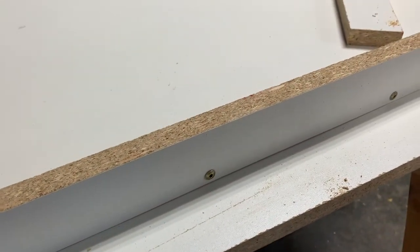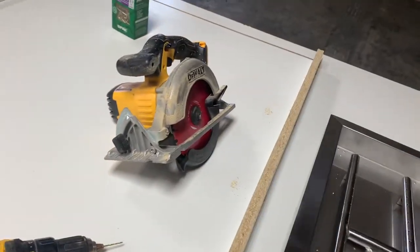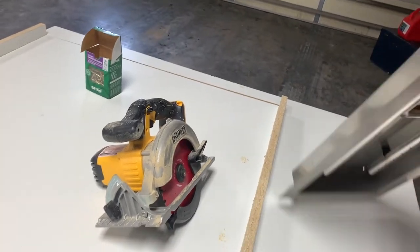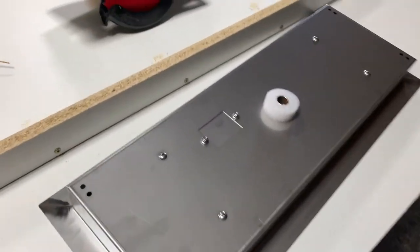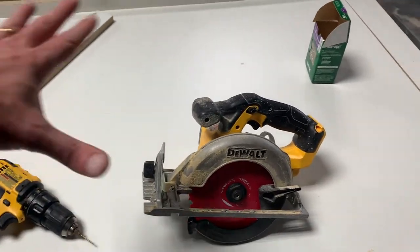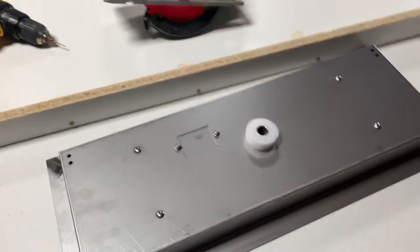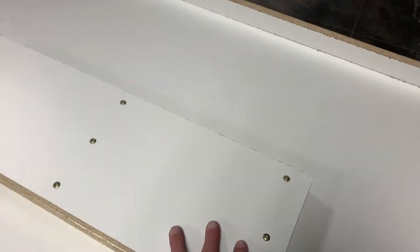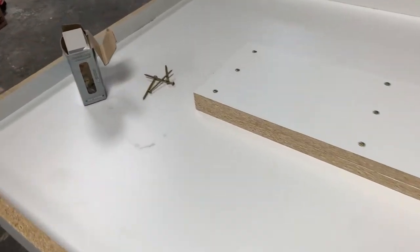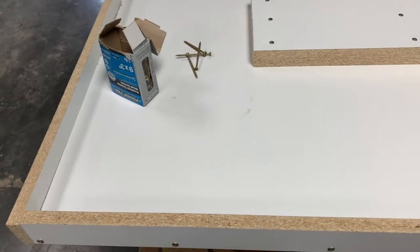I'm using little button head screws on here. Once I get the sides on, I'm going to come in and measure out my burner box, then cut more melamine into that shape - a little bit bigger - and screw it to the middle of my form. When I pour concrete around it, the hole will already be there and I should be able to just set the burner right down inside that hole. Now that I've got all my sides screwed on and the middle piece made to take the form of the fire box, I'm going to get it as centered as possible and screw it down.